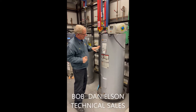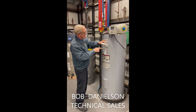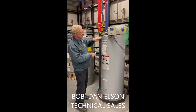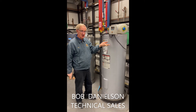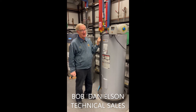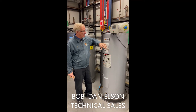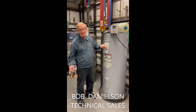A lot of people have this turned off. One of the main issues is that the breaker at the main service panel is turned off. You have to check the main breaker to make sure it's on. That might be all it takes — turning on the 240-volt breaker that supplies power to this — and you'll have hot water in about 45 minutes.